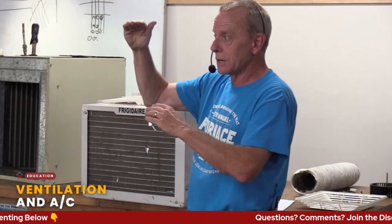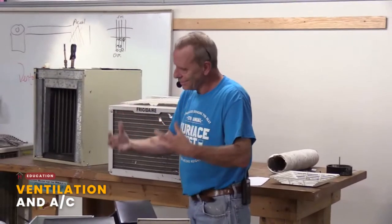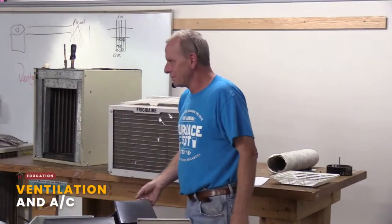But it can be changed. I've seen it where people buy a brand new unit, and then they start going after their house, making it more and more energy efficient, and that's relatively easy to do. Now, all of a sudden, their unit that used to be fine starts to act like an oversized unit because you're making your house more efficient, so the unit is now oversized. That's what I'm getting at with that.